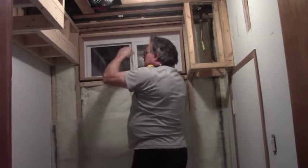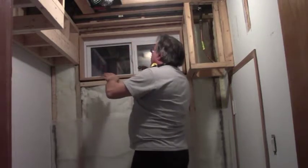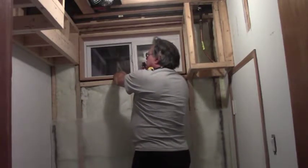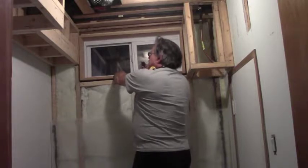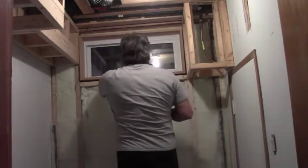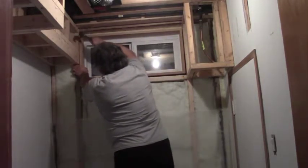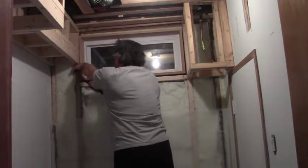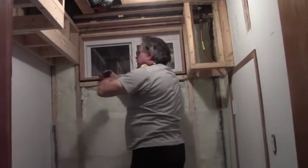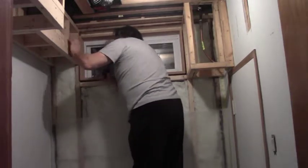Idea to only put one or two small brad nails in this tip. That way, if you do have to tap and it might be a little tight, you can just open the corner up just a touch, just to get it to line up and go in. And then if you need to later, you can just caulk the corner just to cover over what you did there.